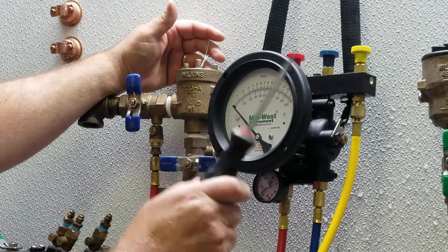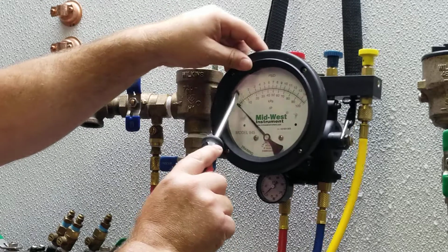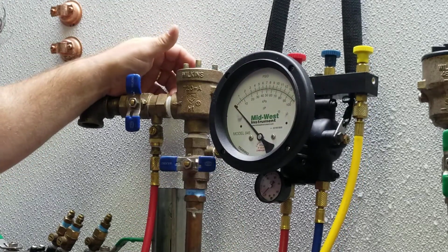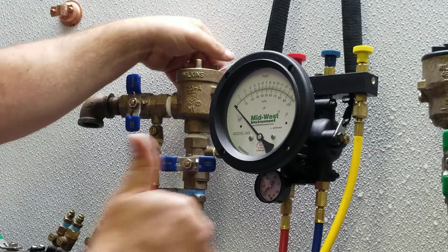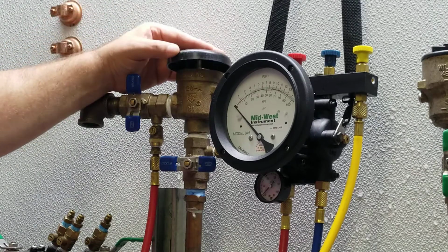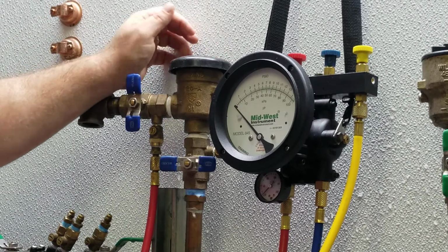If the air inlet is visibly open when the differential gauge reading is 1 psid or higher, record valve as passed. 1.8. Next, replace air inlet canopy or hood. And then restore the system.